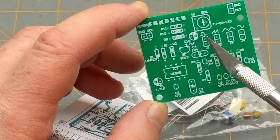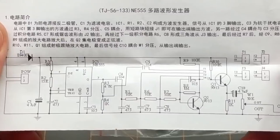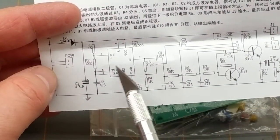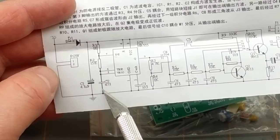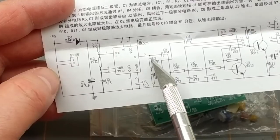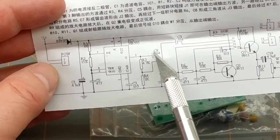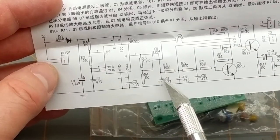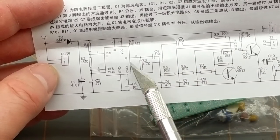Those on the outputs look like different waveforms — I'm going to guess this is a waveform generator or a function generator. Judging from the Chinese instructions I have no idea, but looking at the schematic there's a standard oscillator, a resistor divider, a capacitor, and the timing components. Pin 3 is the output, so that's going to be a square wave coming out of there.